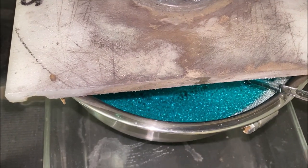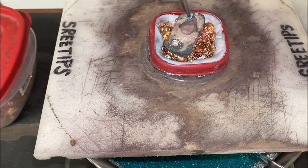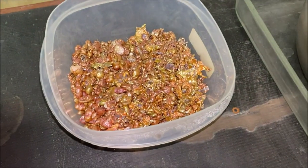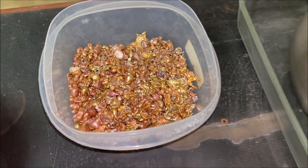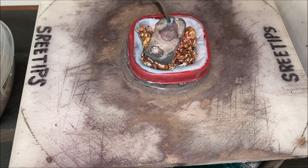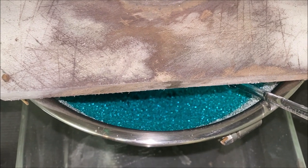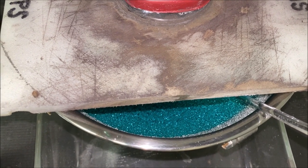Notice that the electrolyte has turned blue, and that is because we've got some copper still in our impure silver shot that we're feeding into this thing. That's what gives it this golden color — a little bit of copper on the outside of the pieces of silver. But as the silver dissolves in the anode basket, the copper dissolves with it and travels down into the electrolyte.